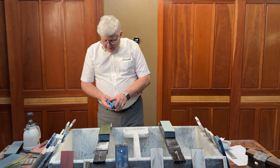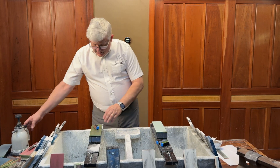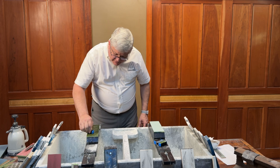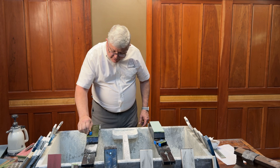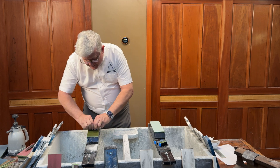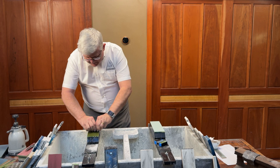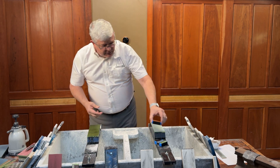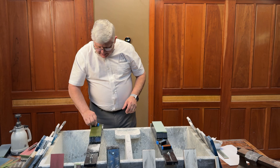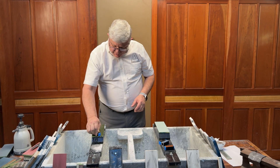I'll do the same demonstration here with the 50 — there's a little bit of metal in it, so I'm going to take the 100 micron groomer and put a little water on here. You can hear it grinding down into the surface — it just grinds nicely. If you want, you can finish with the same grit; just make sure there's no contamination. You can use the 50 against the 50 and finish up there. Now it's just a beautiful surface.